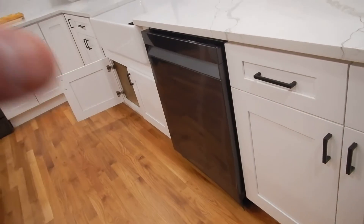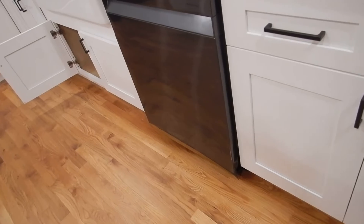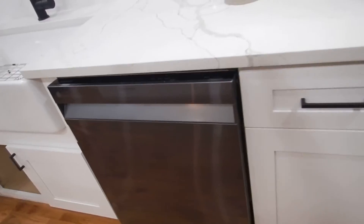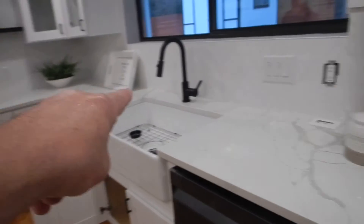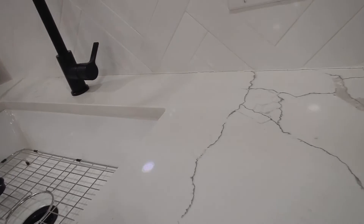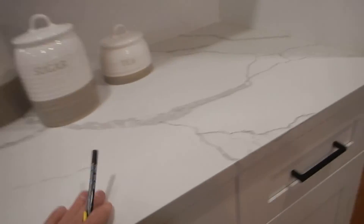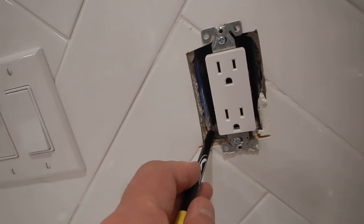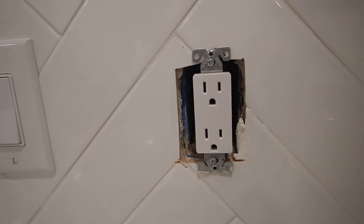It's not GFCI — again, when this home was built GFCI was not required for the dishwasher. But this is called remodeling. If the dishwasher is replaced, it is to be replaced to code. When you remodel the entire kitchen, the kitchen should have been brought up to current standards — so at that point when this kitchen was remodeled, GFCI was required. Now they came in and added all this nice splashback — it looks really nice, I like it — but it comes out farther than the outlet box, so we have a gap right here.